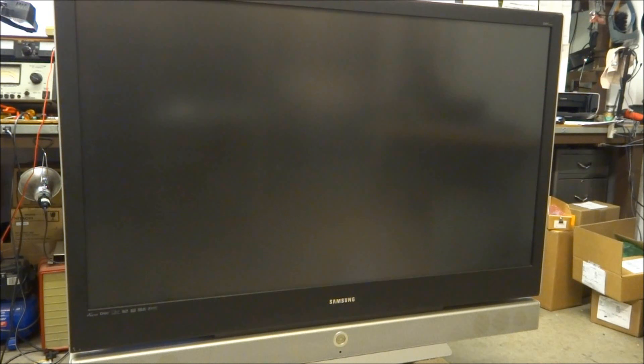Let's talk about this HLR series 720p set. This one does have a bad digital board and it was donated for recycle. I happen to have several HLP series Samsung DLP sets that I've scrapped out — the HLP was the first generation of the L3 chassis. I've had quite a problem with DMD boards going bad in these sets, so I'm going to keep the optical engine out of the HLR set and transfer all the other components over from the HLP series because they're all working fine.